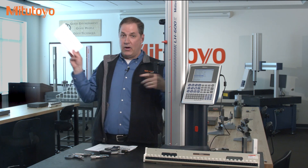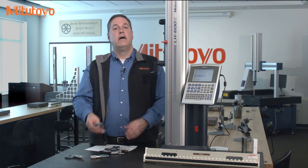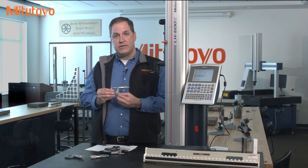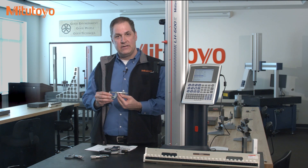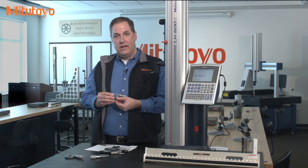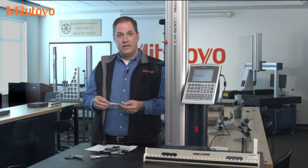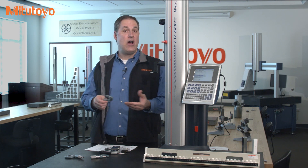So there you have it. According to best practice in the U.S. military in 1950 — a practice which is still used in industry today — an outside micrometer with a thousandths graduation: go ahead and subdivide, go ahead and read that graduation into tenths. Now, I think you need pretty good eyes to see this, and if you question yourself, it's not too hard to run a test to see how good you are.